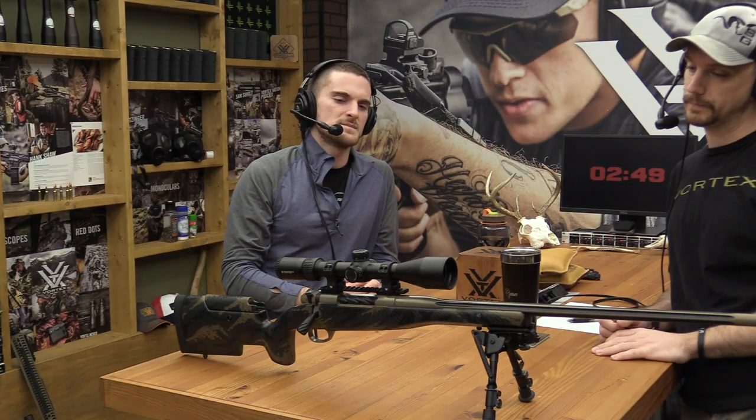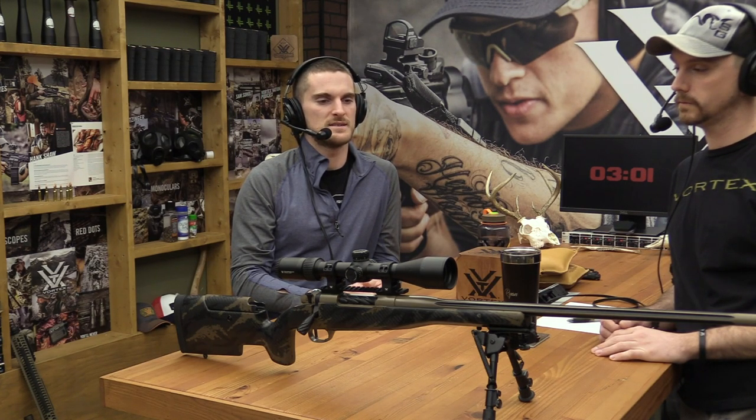I think a lot of times 20 MOA bases, canted bases, get thrown out there a lot when you're talking about long range. And like we said, it's very possible that it may make perfect sense for you if you're shooting long range. But utilizing some sort of canting method, whether it's straight up and down, or in the case of those kinds of rings or other systems that are out there, in all different axes or directions, as a method of correcting for a misalignment in the rifle is one that's often not thought of.